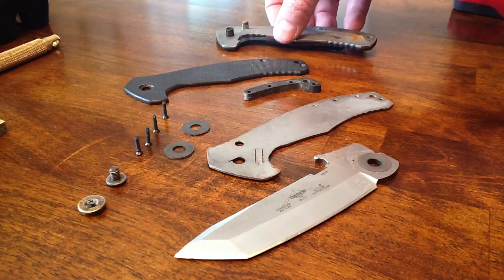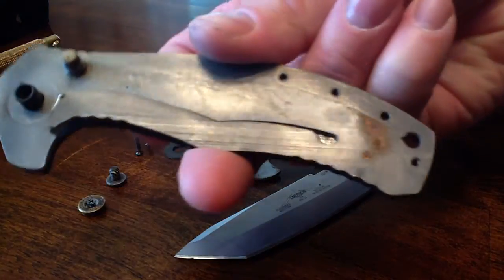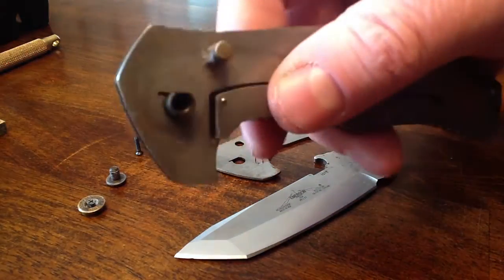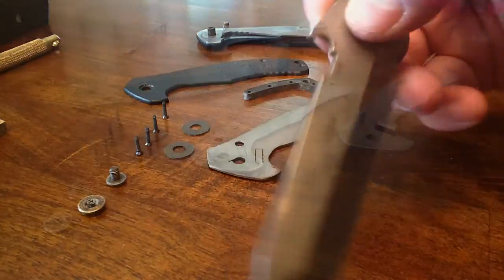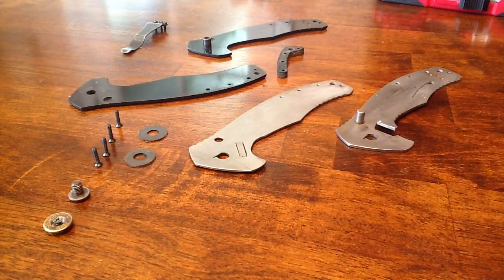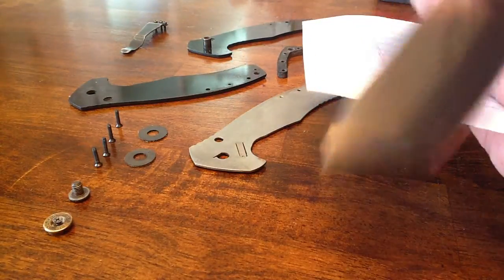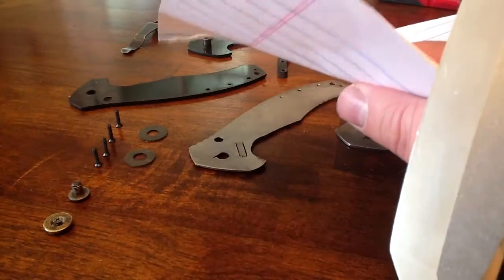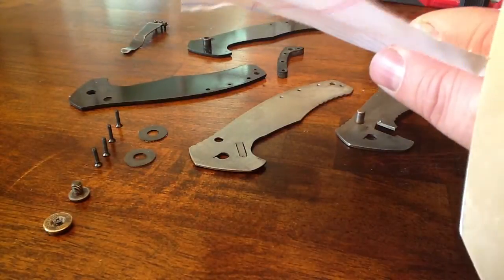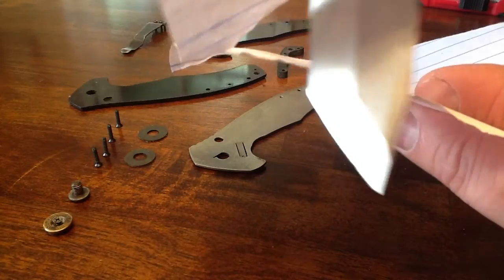All right, so here's the complete breakdown. Take it down, get out of the back — inside, got some rust. Clean that all up, get it oiled, and work on this blade a little bit. So I took it down a little bit more, took the little clip off the back. Bottom of the screws looked like they were rusted a little bit. Here's the blade — just wanted to be able to evaluate. Pretty dull, not even wanting to get on there. It's sure not cutting, it's more ripping. Pretty dull.